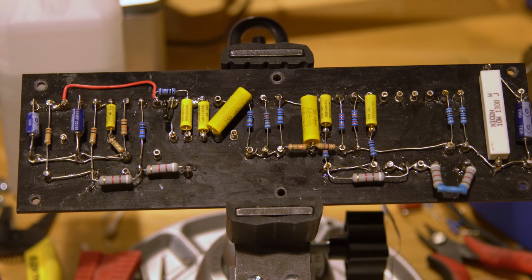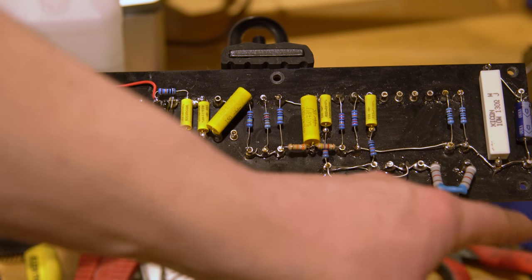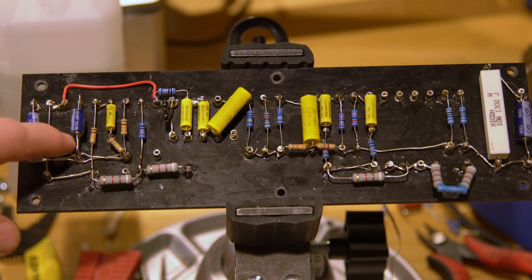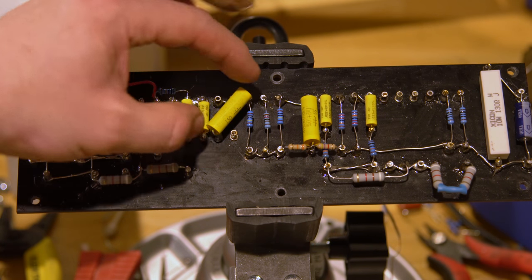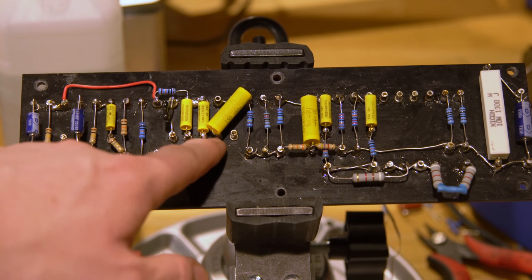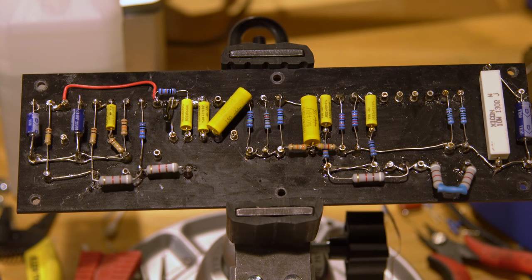So it's all laid out correctly now. I just need to get these missing parts. I will also hook up that part there, and set a 1 or 1.5k 25-watt resistor here that brings the first mains in before it jumpers over. That's the bulk of this done. It's a little weird — I've got some extra jumpers I don't need. This one I'll connect into from the output stage.